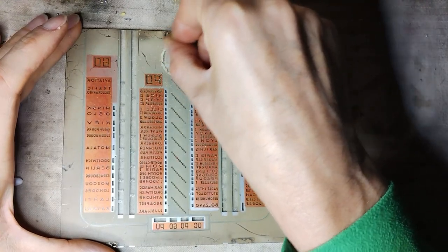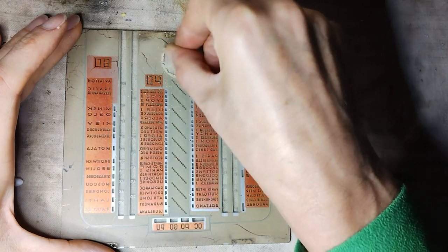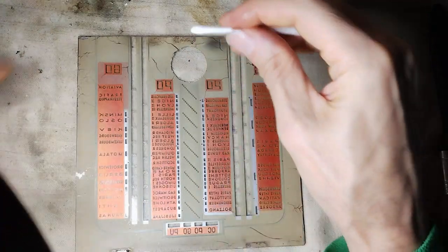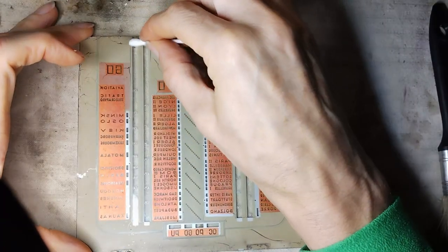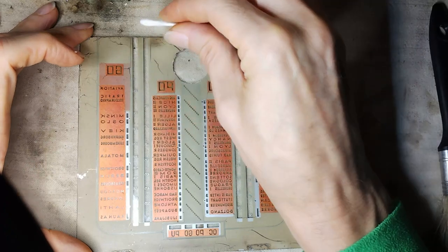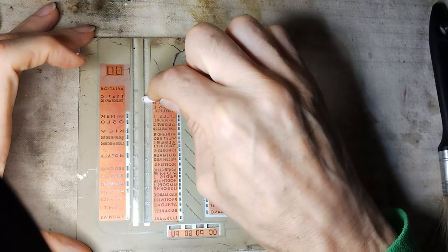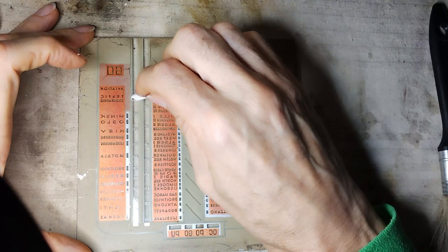This unit came without a magic eye tube, but on the corresponding area of the dial glass the paint is chipping off. Therefore, the residues are removed. The space between the wavelength values is cleaned without touching the numbers. Later, the dial glass will be sprayed with clear lacquer on the back to preserve what has remained of them.